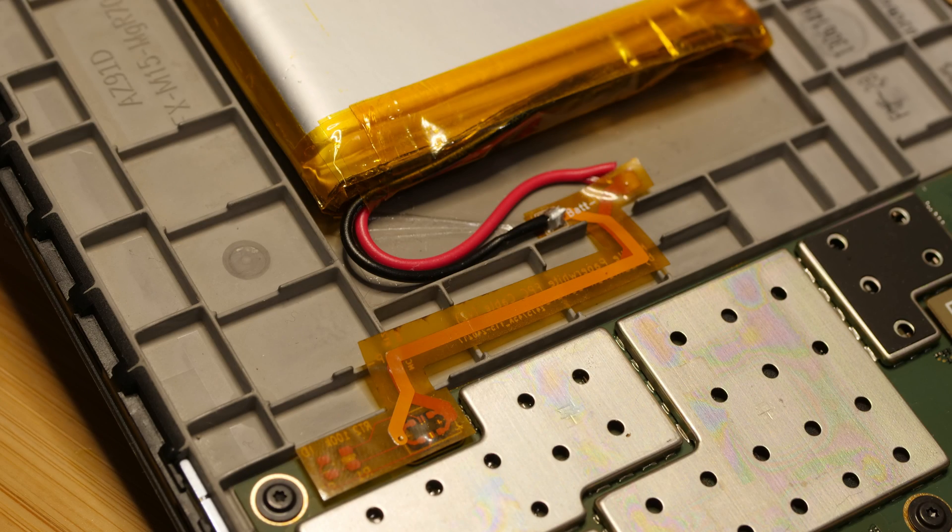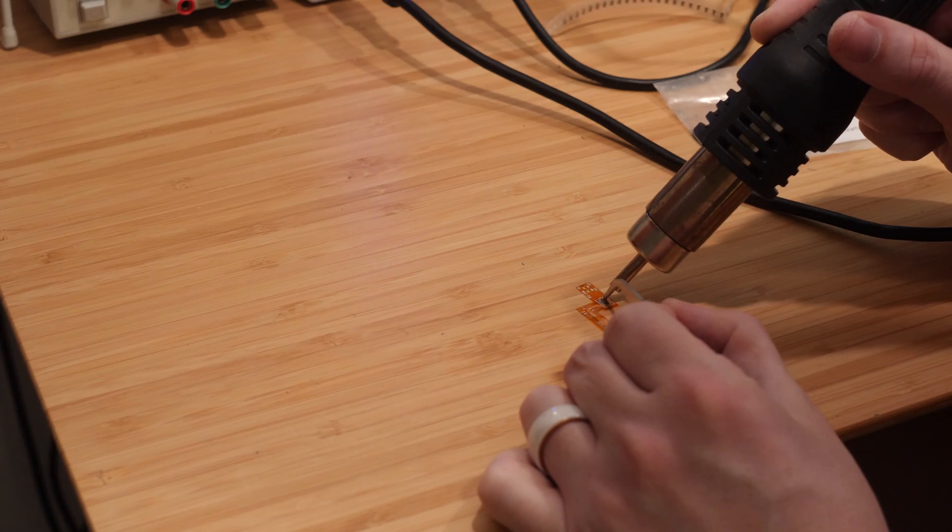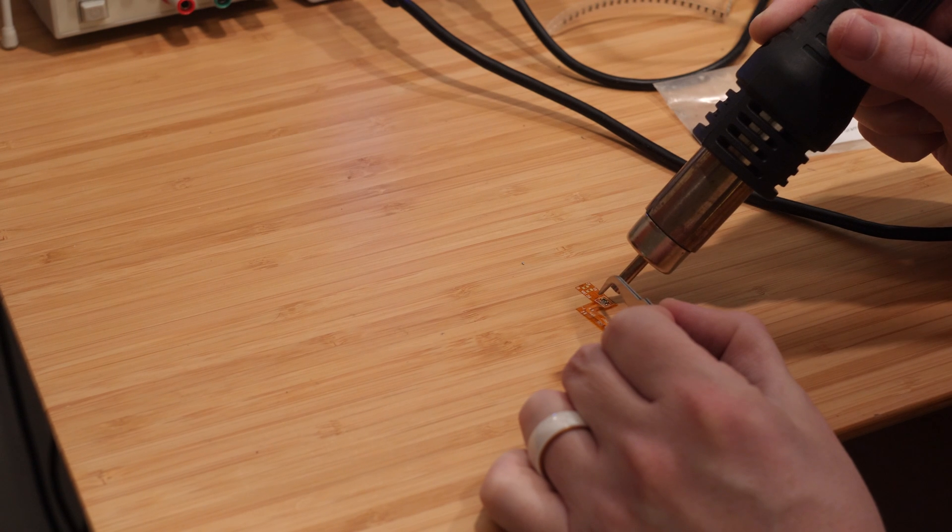The other end of the cable has two big pads for the positive and negative battery connections. Putting this together does require some SMD soldering skills. I recommend a hot plate, as hot air tends to move the components around and melt the connector body. The pins on the connector are tiny and any shifting will screw things up. If you're planning this mod yourself, that soldering is the only part that's difficult. But my frustrations were just beginning because I still had to design the enclosure back.